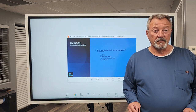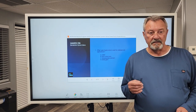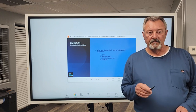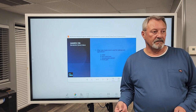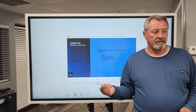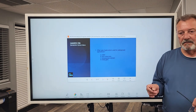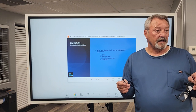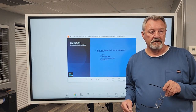So we do a little bit of math: 0.785 times one, because it's a 12-inch diameter, that would be 1 foot. So 0.785 times one times 5,280 feet per mile times 7.48 gallons per cubic foot. So we're taking this equation that's calculating how many cubic feet are in that pipe and then converting that to gallons all in one equation. It's a lot of water.